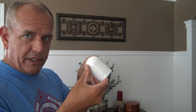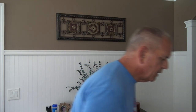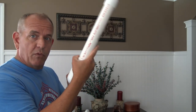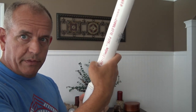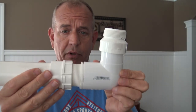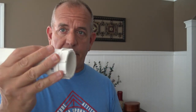The threads are barely tight. When you bring it up, you're unscrewing and loosening it. You can do it any way you want and get any parts you want, but the important part is: if you glue all this together, when you try to screw it in, it's going to hit the stairs or side of the pool. So you have to have this tube so it can unscrew. You also want a threaded section so that after you install it, you can take this tube and screw it on. The key elements are making sure the thread stops pointing down and that this tube can unscrew.